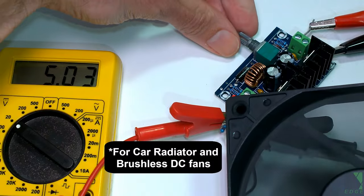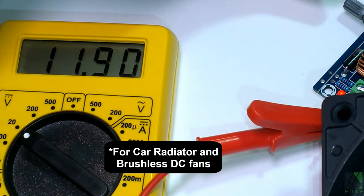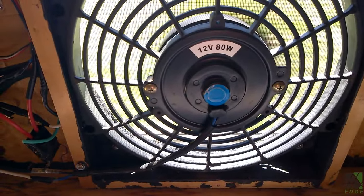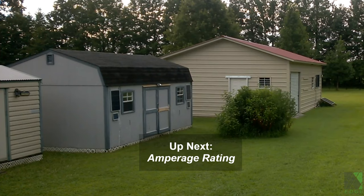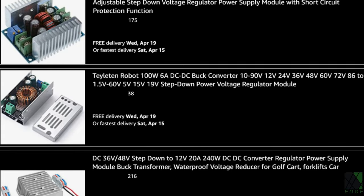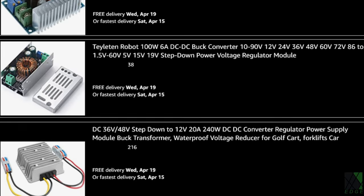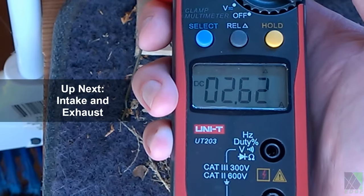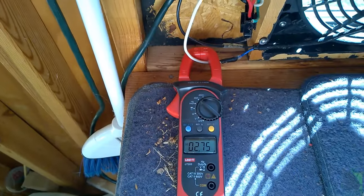Plus, I can control the fan speed. An adjustable DC-DC converter is another one of my favorite options. The adjustable DC converter is able to both regulate the speed of the fan and also protect from over voltage. One benefit of slowing down the fan speed, say below 10 volts DC, is that it will last much longer. My oldest fan has been going strong several seasons in part because I don't run it at full blast all the time. DC converters and PWM motor controllers are usually overrated — they might claim the device can handle 10 amps, but in reality they can't survive that long term. Also, the shed is going to be hot, further reducing the current rating of the device. A typical car radiator fan might pull 5 to 10 amps, but running it at a lower speed will reduce the power draw. A DC amp meter can be used to check how many amps the fan uses.